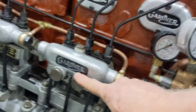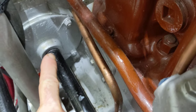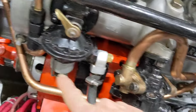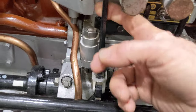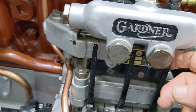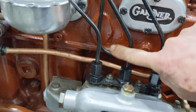These are your fuel injections set up here, so this is the drive system. It gets driven off the engine chain up in here — you can see this shaft going inside into the chain case where the timing chain and everything else is located. This shaft is driven, and then this shaft around here is a PTO power takeoff, and I'm using that for one of the two electrodines. The other electrodine is up here, driven by a belt off the front. This shaft here drives the injection pump, so there's a series of cams in here. Each pipe then comes out with the high pressure lines.